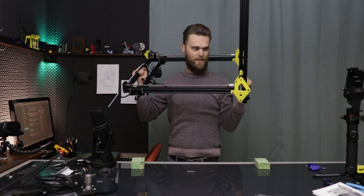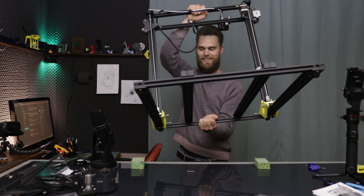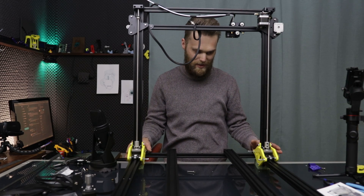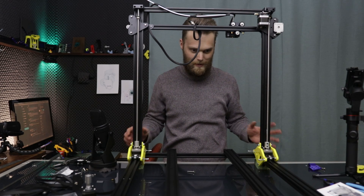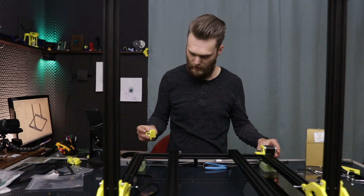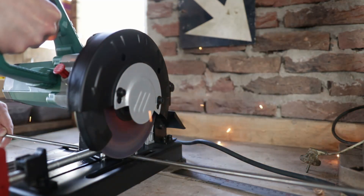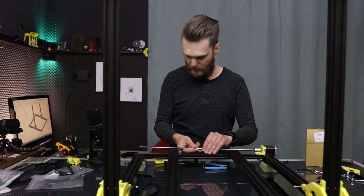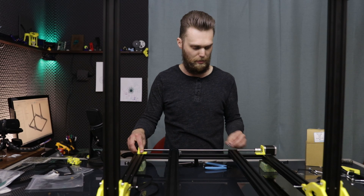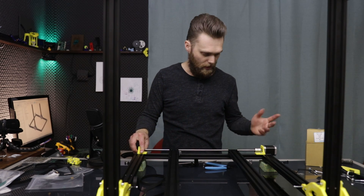I think I'll just keep it like this. I'm going to do some minor changes and print it out of a better-looking material, and focus on mounting the bed. I've made a bracket for this motor so it can fit here and on the other side with the bearing. I've shortened this 8mm rod and can couple it to the motor. The only thing I have to add are the pulleys, but I bought 6mm wide pulleys and I need 9mm, so I'm still waiting for those parts.